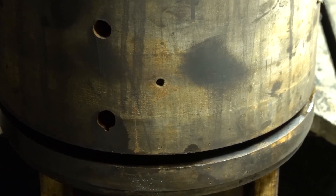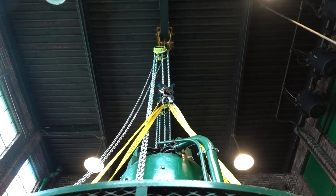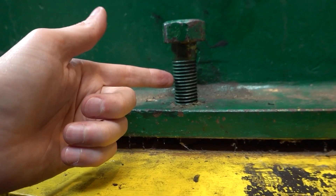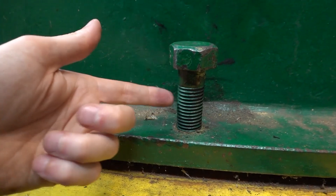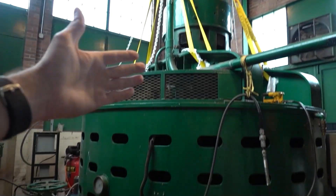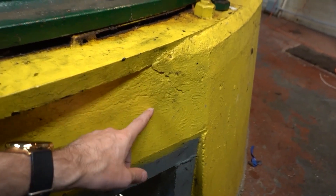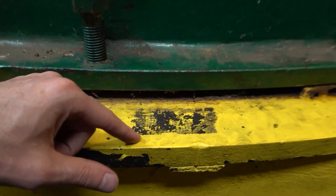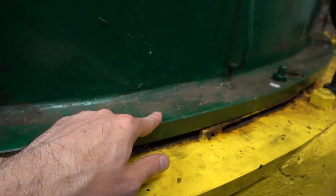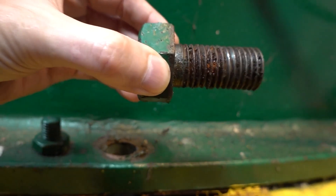Just to make that little gap there, just to open that hatch, we had to lift this up with that giant combination of rigging and these jack screws. When I mention it's holding a substantial portion of the weight with all the rigging, it is. The rest of the weight is being held on these little jack screws. Big M — my sexy generator — sits on a concrete plinth, which sits on the floor and holds the weight of the whole thing. Resting upon the concrete plinth is an inch-thick ring of solid steel. That piece of steel normally bears the weight from the flange on the main housing, and the main housing has these hold-down bolts that thread through and down into the piece of steel to hold the generator down.